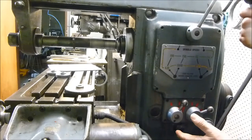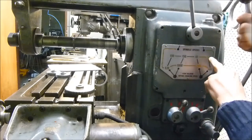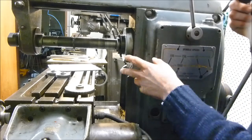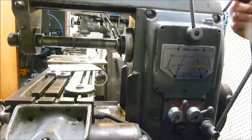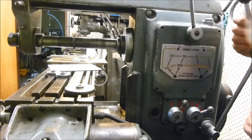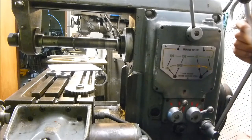I figure with most of the work that I'll be doing, I'll be using the low ratio and probably these speeds up here. Because with reasonably large cutters on the quill, the surface speed of the cutter is going to be fairly high, and we probably never need to use any of these high speeds.